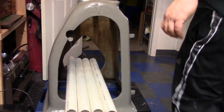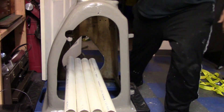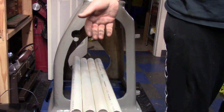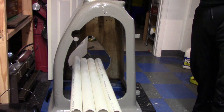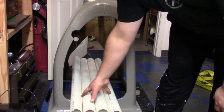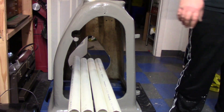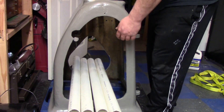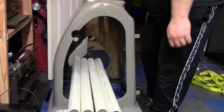I want to get the drive unit in place here. I have the motor plate mounted to it, and on the other side are two babbitt bearing housings that a rod slides through — that catches the ears of the drive unit and allows it to tilt up and down to slack the main belt. I got some PVC in here because it fits in nice and tight to make a kind of false floor, since that edge is rounded and it's plenty strong enough. I'm going to take a tie-down and hook the drive unit and see if I can raise it up like that.